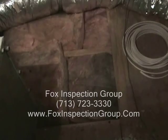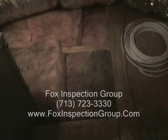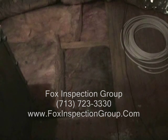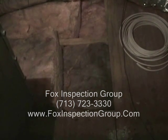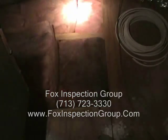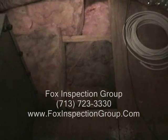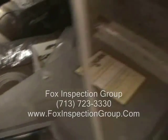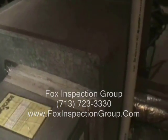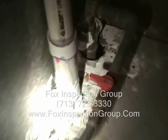Let me take it off. Do you notice that this insulation right there? Look close — it seems darker. That's because the return air chase is drawing air through. The return air chase is not sealed; it draws air through the surrounding insulation. That discoloration indicates a return air chase that is not sealed. Then we have a hole where a gas line goes down.